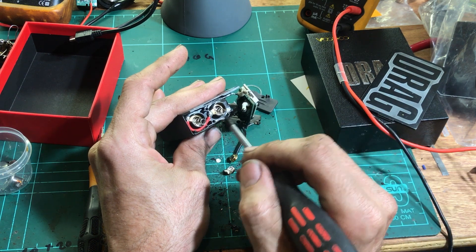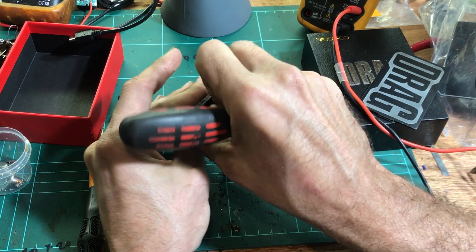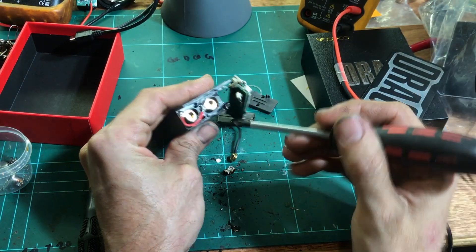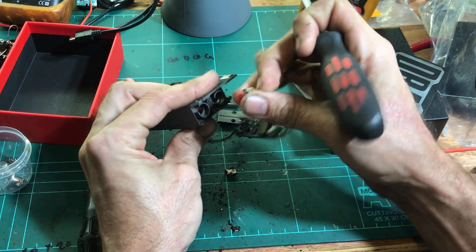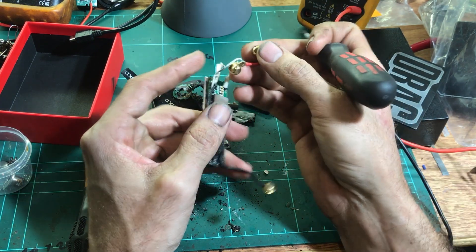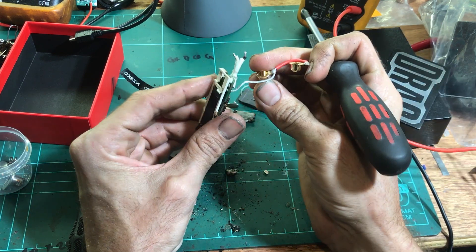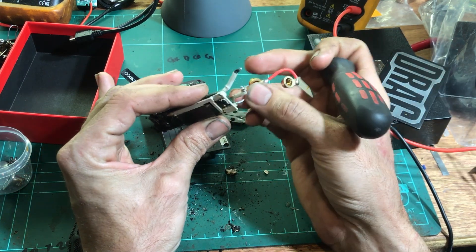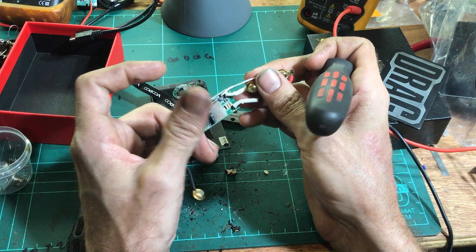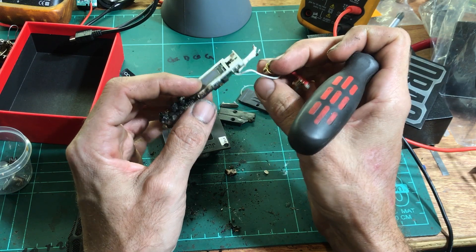These connections in here — it's pretty obvious that the bottom one was really burnt. The positive wire coming from that cell saw a lot of current. But the top one — it's kind of weird because the current's got to go somewhere, it's got to go in a loop. It can't just come out of the positive and go into the board and fry things without it going somewhere else. So it's a bit weird how that's so burnt and the other negative isn't. These contacts look okay — that wire's not really burnt, the contacts aren't discolored or anything.